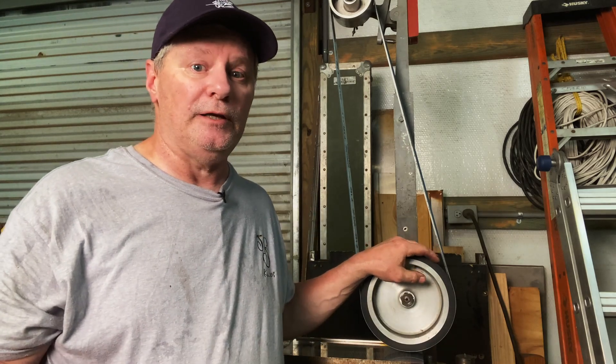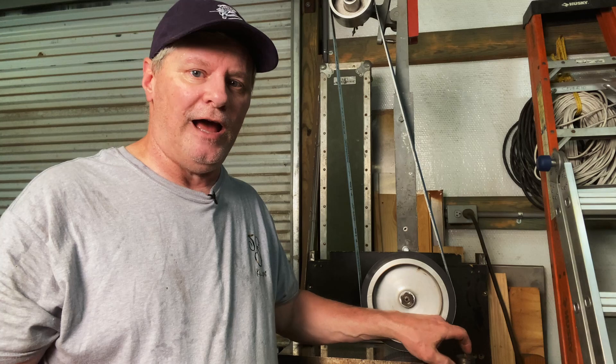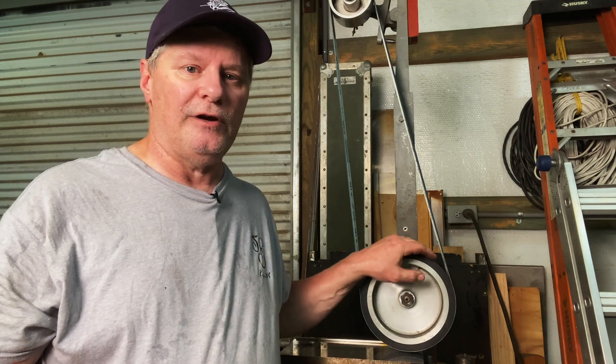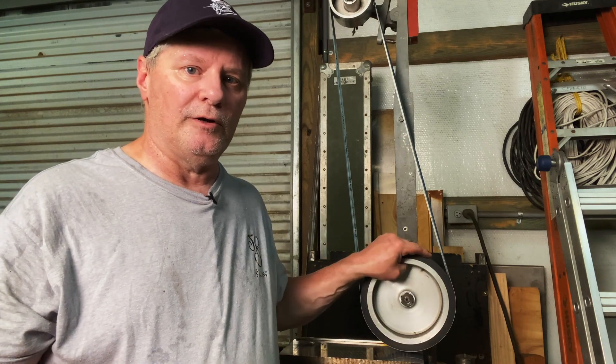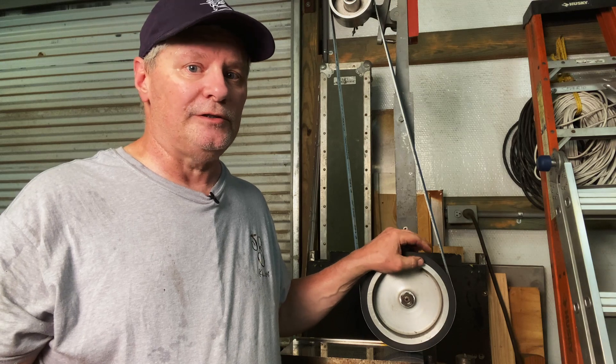I've come out pretty good, but I think it could be better. The wheel I'm using is flat and it's probably not quite 90 durometer. I also saw on Instagram where Master Smith Rick Dunkerley is using an aluminum wheel for his surface wheel — he took his diamond dresser and put a carbide insert in there and squared his wheel with his chuck. It's pretty interesting; I might go to something like that. Never seen anybody use a hard wheel for a belt conversion — it's always been a rubber contact wheel. I think a serrated wheel might run a little better, and also a harder wheel. This is an old wheel and they didn't make them as good back then. But even still, it's going to get me by. It's doing a pretty good job. I finished a piece up to 400 grit yesterday — it looks pretty good, and it measured the same all across a piece of steel. For what I'm doing, that'll work just fine.